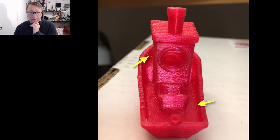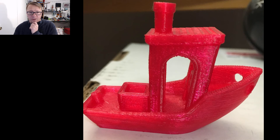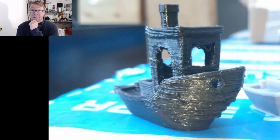Didn't touch it, didn't do anything to it. The porthole overhang is very, very good. The last picture shows the opposite side — it did a little better with the overhangs in the doorway. It came out fantastic as far as I'm concerned. I've seen a lot of pictures of the Benchy and not all of them are fantastic. I'm going to tweak the extrusion multiplier in Simplify 3D and maybe print another Benchy to fix the holes on the decking, and see if that has any negative effect on the portholes or overhangs. Even the window bridging is marvelous — and this is just stock settings, right out of the box. The stock settings turned out to be probably the best of all of them.